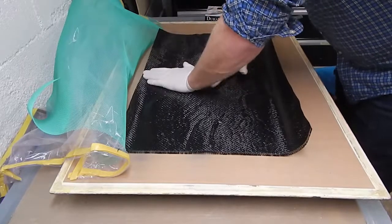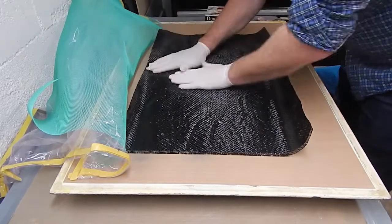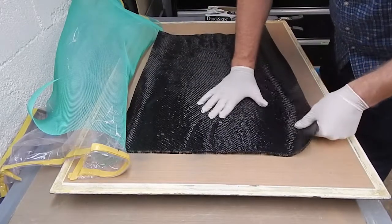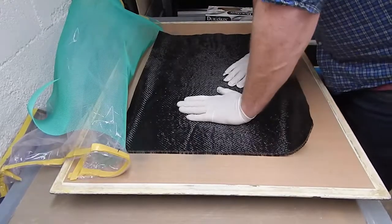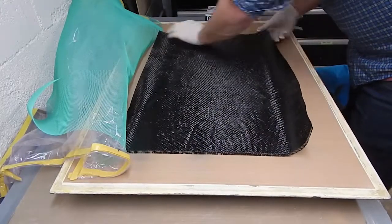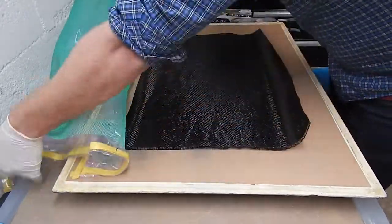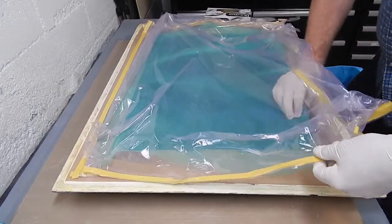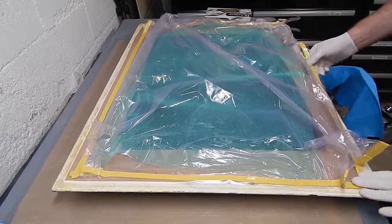I'm working in a pretty cold area and it's taken a bit to get the material to stick down to the Teflon. I'll give it a quick debulk. I'm using latex gloves which happen to have powder on them — for prepreg you'd normally want to use something without the risk of transfer and less likely to tear, but for now it's better than no gloves at all.